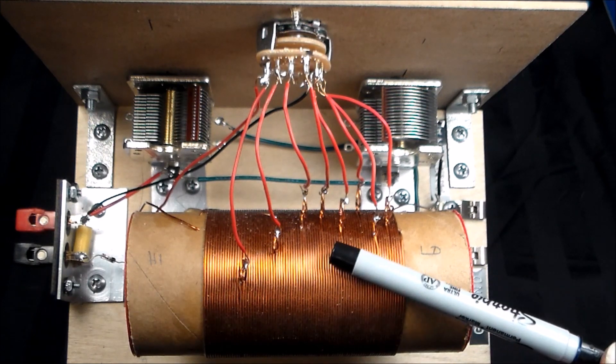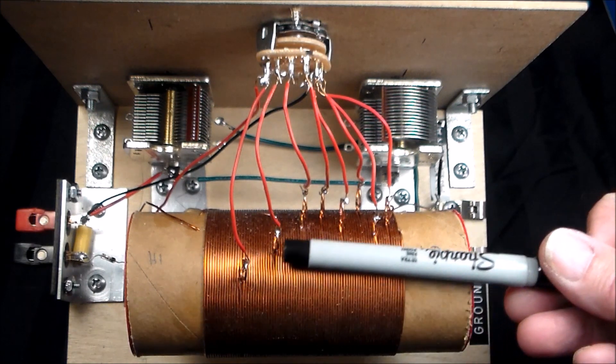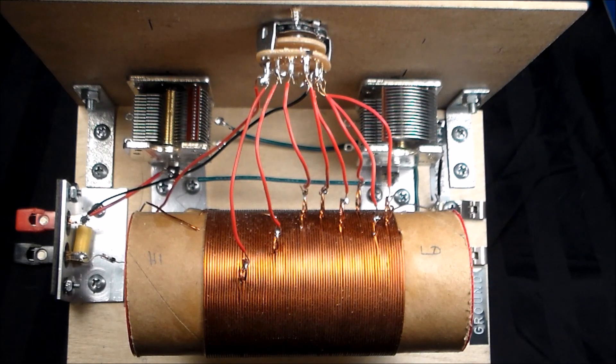This way, I will be sure to get all the performance this circuit can deliver. Here is the 80-turn coil, wound on a mailing tube two inches in diameter and coated with varnish. I never use bathroom artifacts in my radios. The taps are loops connected to nine points on the rotary switch. They let you make the coil longer or shorter according to what part of the broadcast band you want to tune.